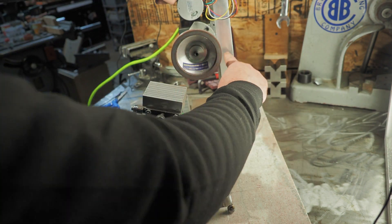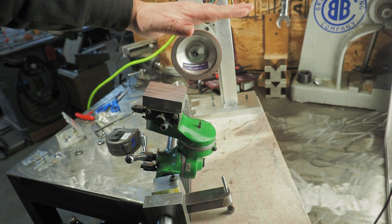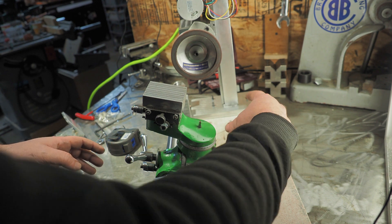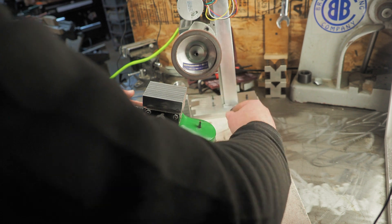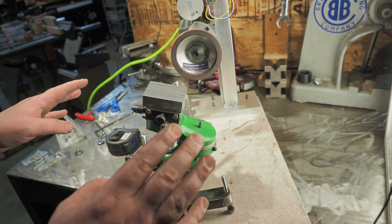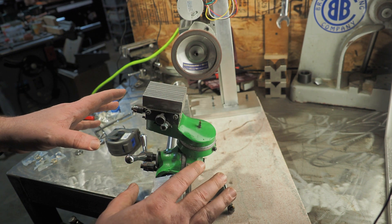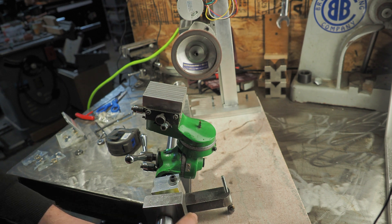There's a dovetail on this and I have a couple of set screws and a gib that actually allows me to move this whole thing up and down. One of the things I imagined being able to do with this is to have a purely linear slide ability that I can also mount to this granite plate. I haven't done that quite yet but that's the long-term thinking. So let me get this set up, flipped over and get this bolted to the other thing.